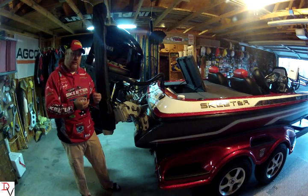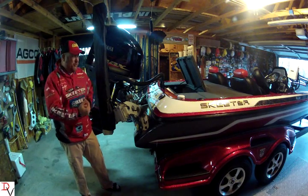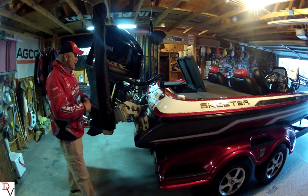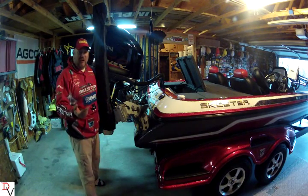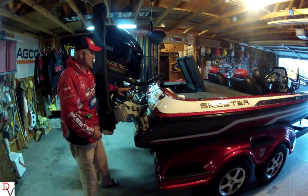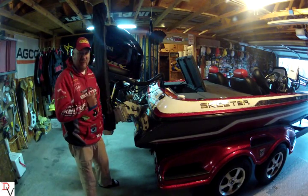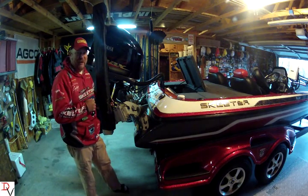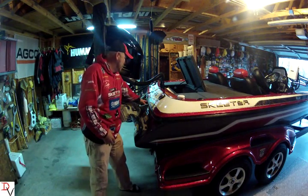The other thing is I can fine-tune the boat to the load that day and the conditions that day. If it's windier and rougher and I want to put more boat down in the water, I can lower that jack plate and be safer. My big reason is to fine-tune the conditions while I'm out there running — I can watch my Humminbird GPS and it's going to tell me what the motor is doing back here and give me the performance from that jack plate.